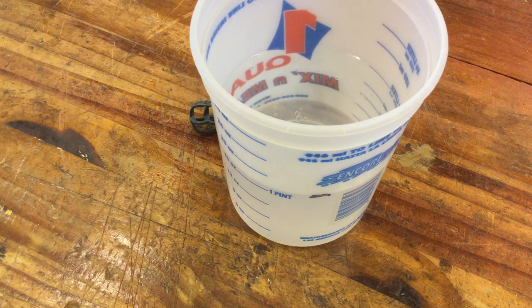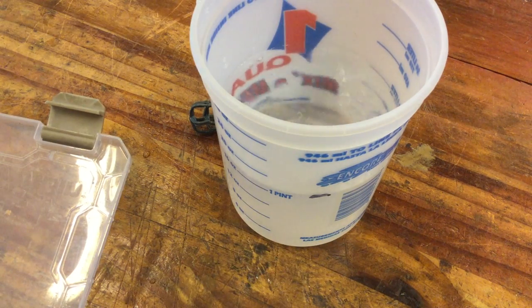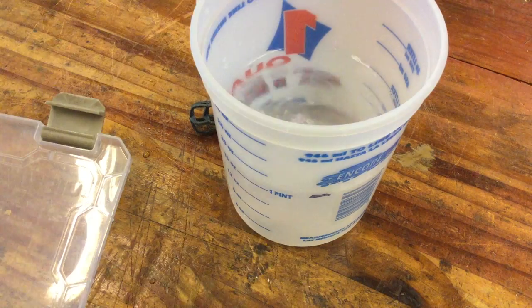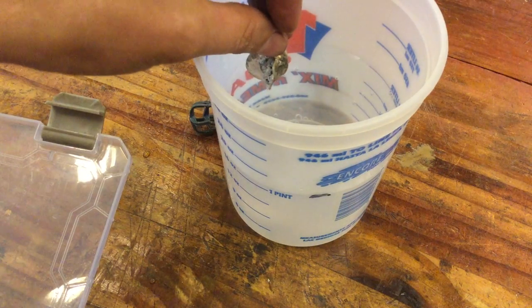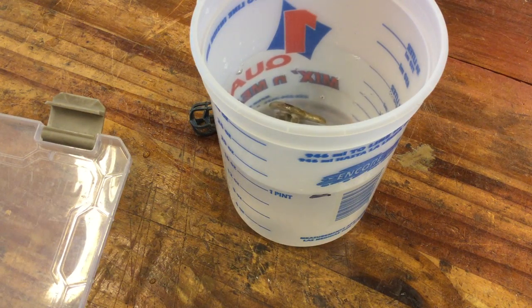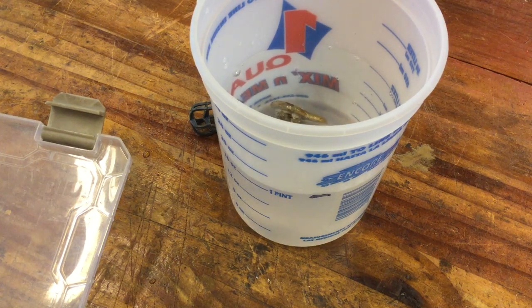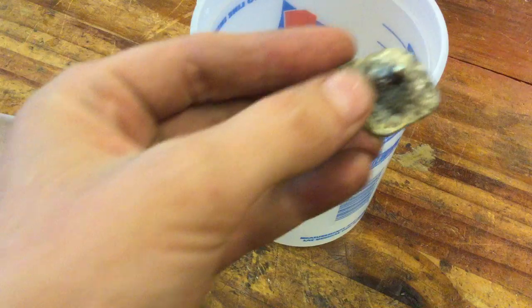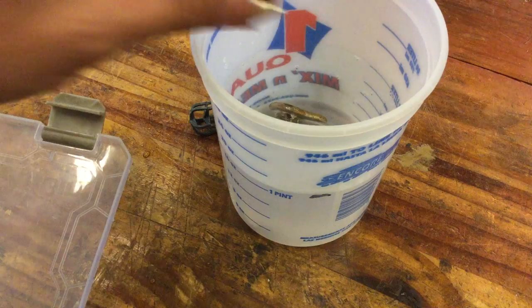We need to determine how much metal needs to go in to be equivalent. That can be done very simply by taking pieces of silver and dropping them in until you reach the volume of your line. I'm taking components I've cast previously — we're above the water line — and then we want to add enough for our button. This is a good volume for a button. So we know we're slightly over, and a little extra for good luck.